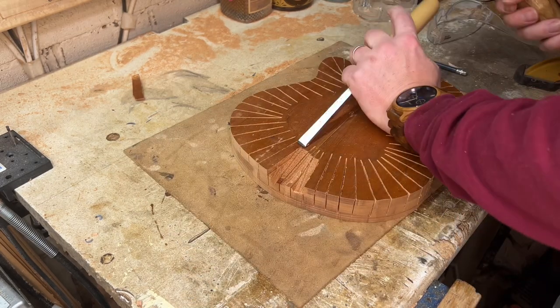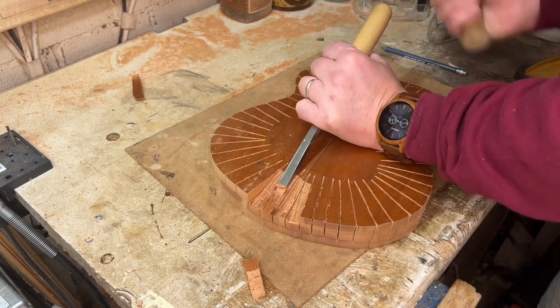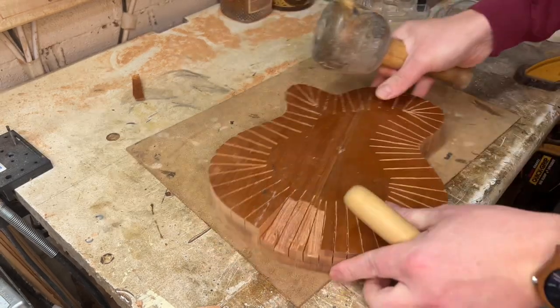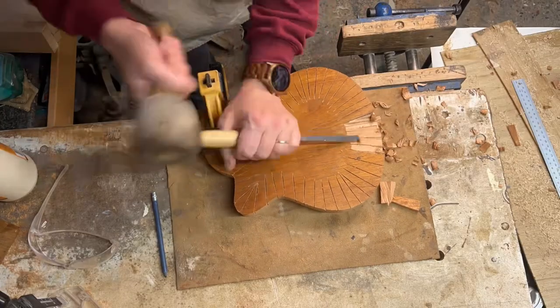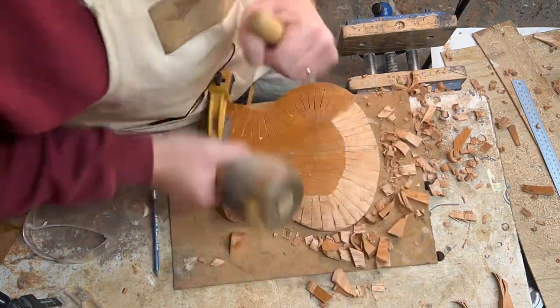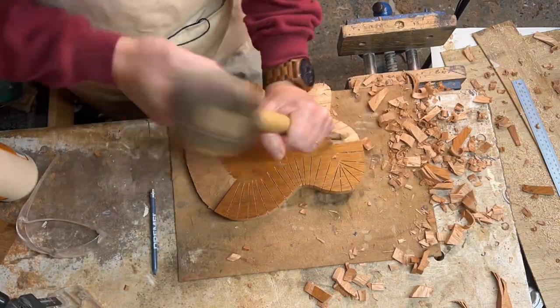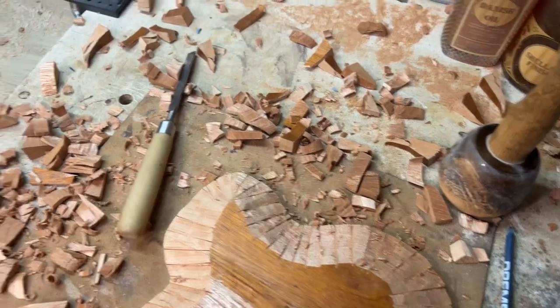I love a bit of chisel action, so I'm going in straight away and chipping out a lot of this excess in big chunks, really quick. You can see how quickly we can remove all of that excess — I know I'm not going too far because I'm not going deeper than those cut marks. Look — all that excess removed, and that took no more than 10 minutes. It takes a little bit of cleaning up, but nothing like the time, dust, and mess that would happen if you went at it with an angle grinder or sander.